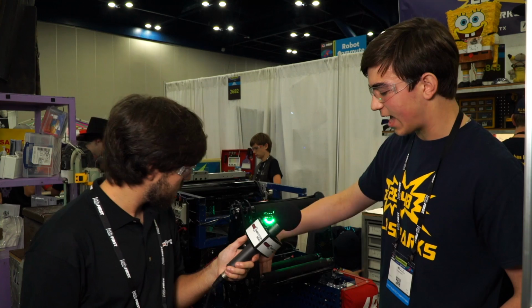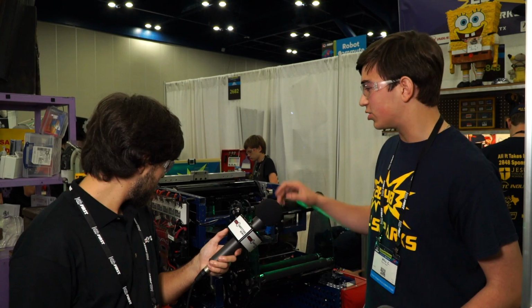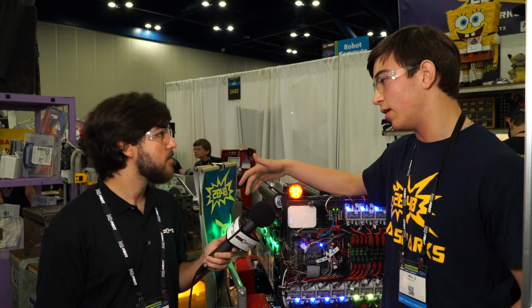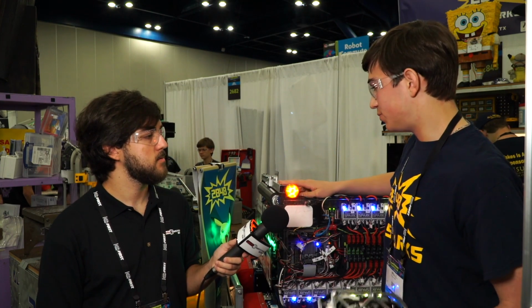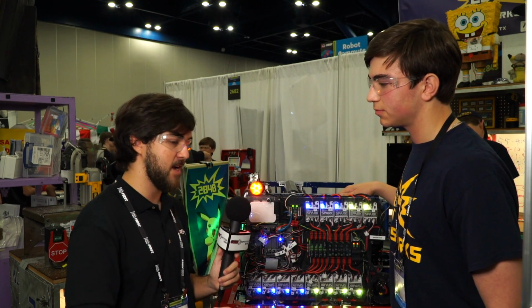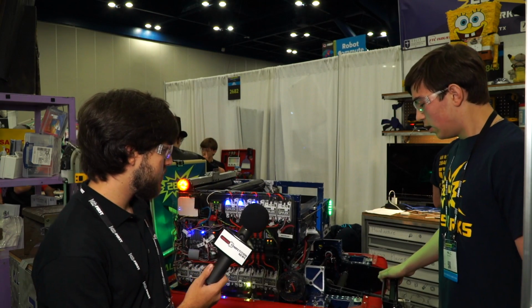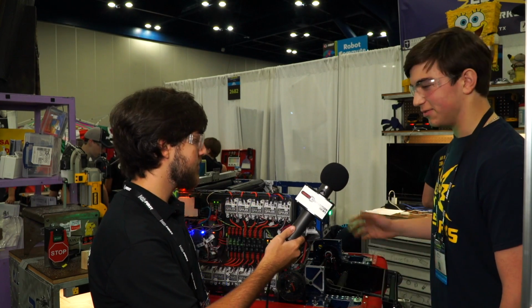Finally, there's a sensor that detects if a gear is in. It's another photo gate sensor. So when we put in a gear, we'll actually send a signal to the back of the robot. It'll flash green when we have a gear in the robot, and then when it's red, we don't have a gear. That way the drivers can sort of see what's going on, even all the way across the field, because when it's a floor intake and it's on the outside of your robot, it's impossible to see how you're lining up. Yeah, exactly. And so that's basically it for this guy. That sensor also tells it to stop the rollers in time, so it doesn't burn out the motors.